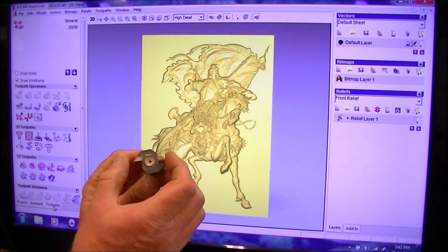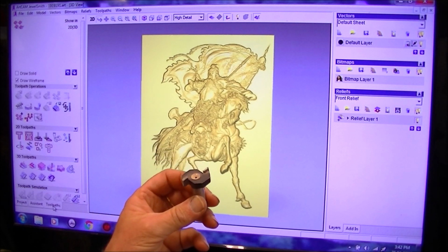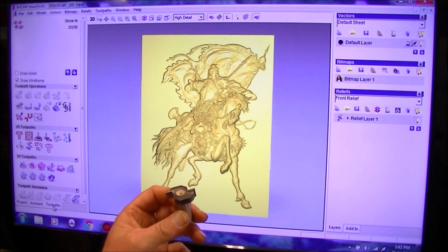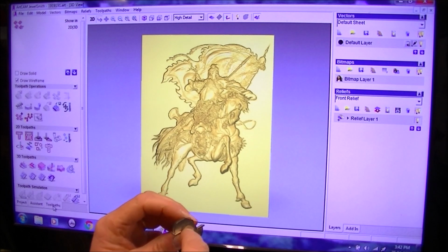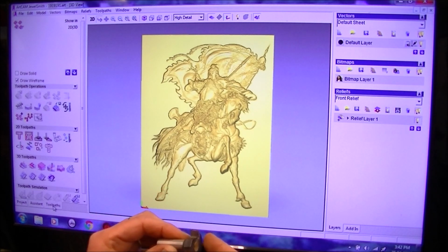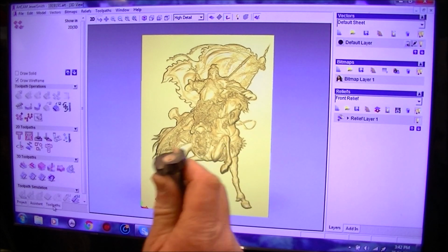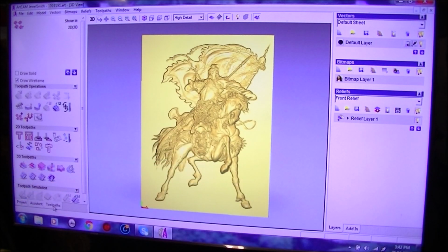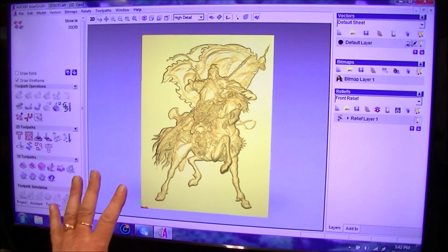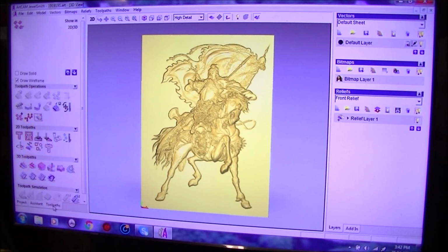This is 32 mil in diameter. This is a tool that I actually modified myself because on here there was a bearing. I believe it's some sort of dado tool. So we're going to use this one to remove a lot of the material very quickly then. And we're actually going to make a new tool in the tooling list within ArtCam CAD-CAM.